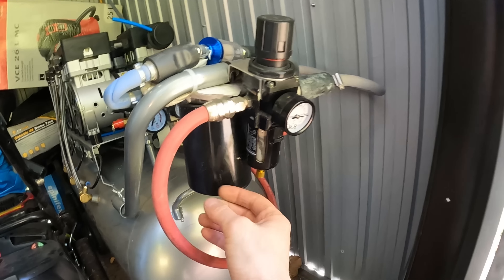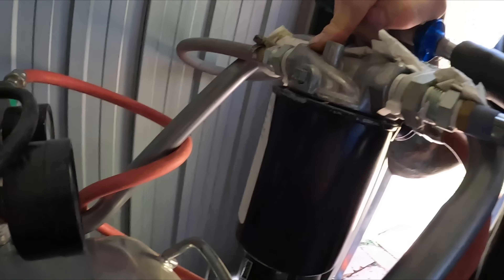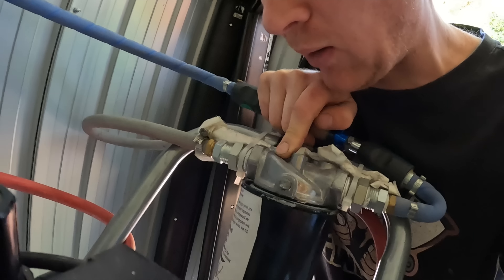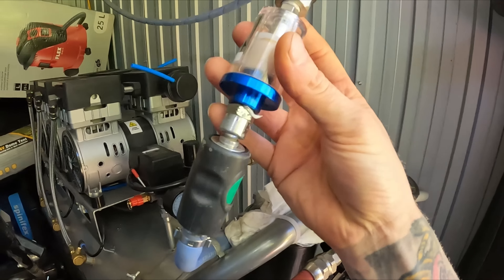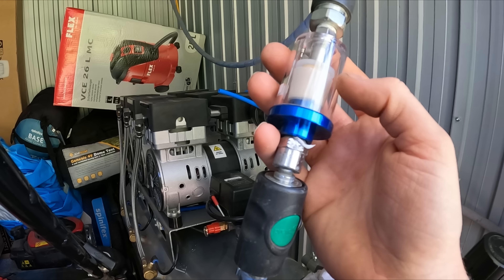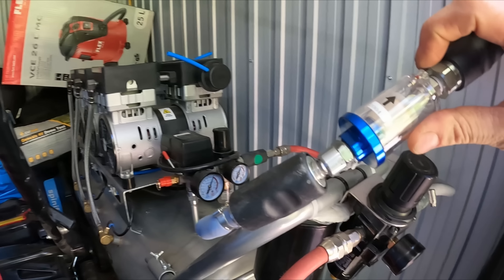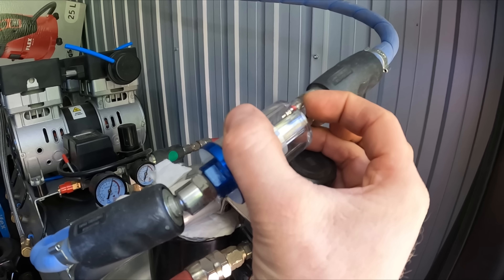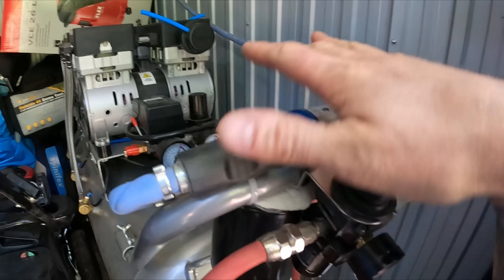After that, the next filter is another moisture trap — a proper filter. This one is Steel Camel and it's done very well. Lots of people seem to always ask about Steel Camel whenever I do videos, so I will be putting a link in the description below. That's not sponsored, although they did send one out a long time ago. After that, this is just more like a last line of defense — I put this one here just so I can see if everything is clean, and it is. That's just a way for me to visualize whether there's any moisture coming out, and there's not. There's a little drainer but there's nothing to drain.